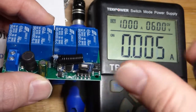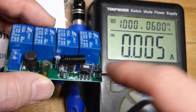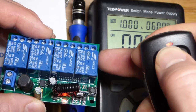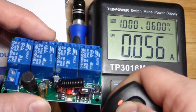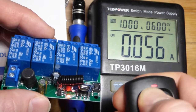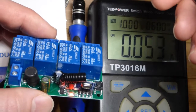Let's see if we do it again — yep, there's that flash. I think that's all we needed to do to program it. There are other options like pressing twice or three times, and eight times to reset it. Now I press A — I think that switched, and when I release I think it will de-energize. The coil is energized now, and when I let go it de-energizes. So the coil is only energized while you press it. Before, you could press it and it would stay in position until you pressed again. So: B press/release, C press/release, D press/release.